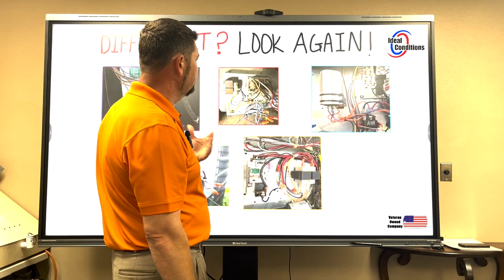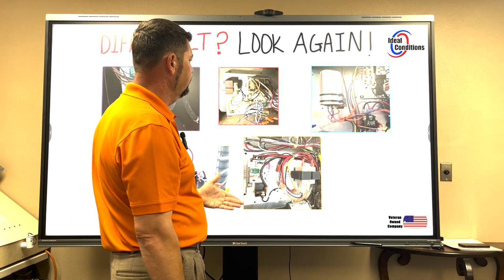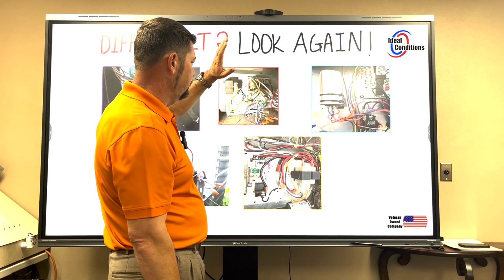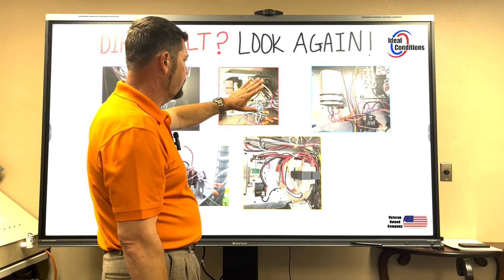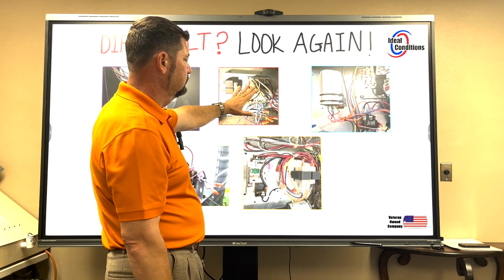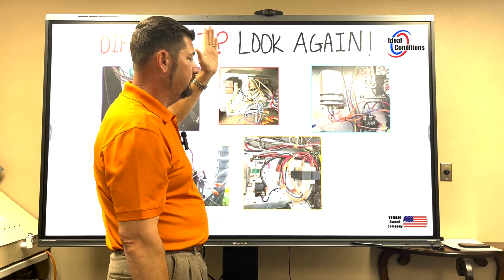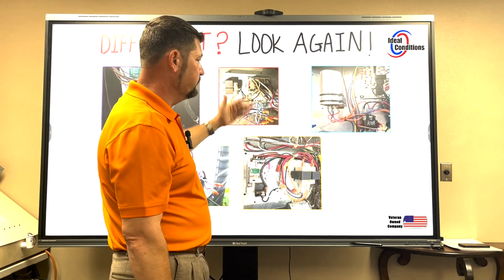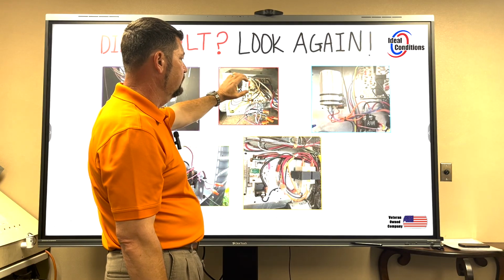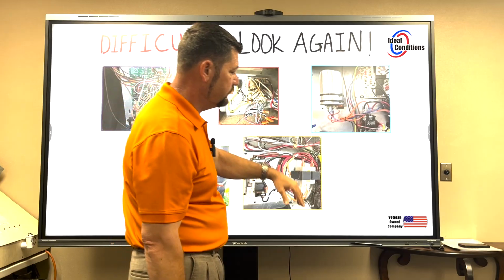As we're starting to look at this, we want to say, hey, this is pretty easy. Now this image here, by the way, is a heat pump, so I'm not going to cover this image. But if I were to look at this, I would say this is a Y, this is an O. That's it. Why? Because it's got a contactor, and O, it's got a reversing valve. It has an R and a C specifically for the defrost control board because it's a load. Cover that in the next video. Let's go back.